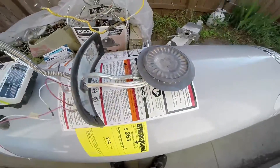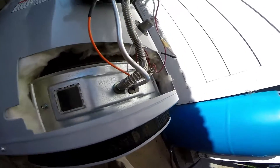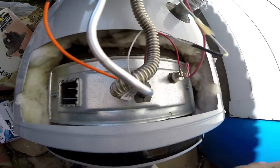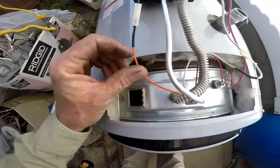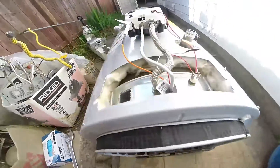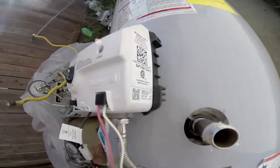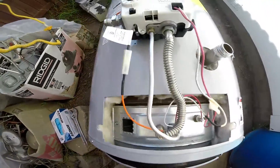Here's the finished installation — it's right in there. I went ahead and changed the cover, so I don't have that sensor anymore; now it has a door switch which is not tripped, so we like that. Everything else — wires and plenty of tube — you can fold it out of the way to put the cover on. This is actually a warranty return and I think we know why they returned it. I'd say it's like a 2019 or 2020, the tank's in great shape. Did a hydrostatic pressure test on the tank and everything's fixed up, so we'll be firing it up.